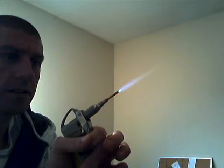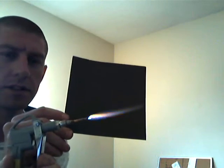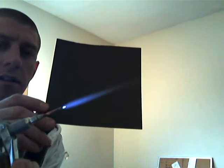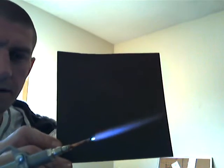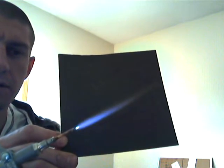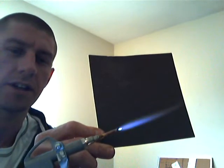This is the ideal flame for this particular torch. The more sunlight you have, the more visible it is — couldn't see this in previous clips of the video. That little tiny white hot cone at the very tip is the hottest. Every torch will be different. The brighter that cone is, that's kind of how you dial in the sweet spot. Make that little tiny cone as bright as you can get it.